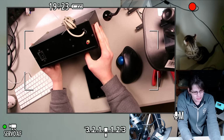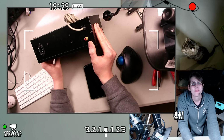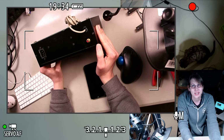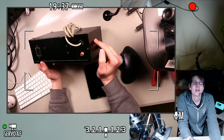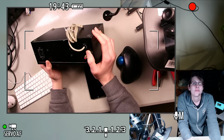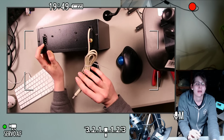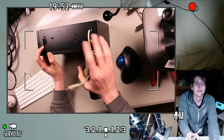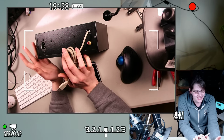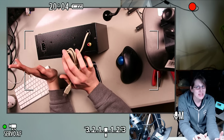The other weird anachronism about this is from the age of really, really early USB, because I designed this with stuff that was relatively hobbyist accessible in 2003, which is still when a lot of people were just getting USB ports on their computers. So you'll notice it has both an IEC style power input jack and USB with a captive cable. This was me following the USB spec really closely, because the VFD drew a little over 500 milliamps, so I didn't want to burn out anybody's USB port.